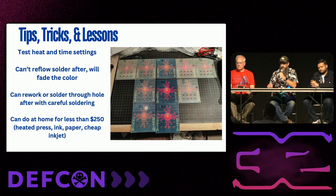Some tricks: time and temperature make a big difference, so I always make sure I have enough extra boards to test — do I need to go hotter, do I need to go longer — to get the best color transfer, because it can vary wildly. It's really hard to get deep black color, but really easy to not get deep black. The whole setup for me is under $250, so it's approachable for the home gamer. I've done about 100 panels in about four hours and been okay with that.